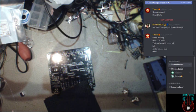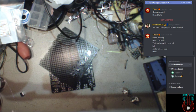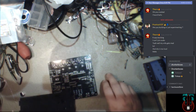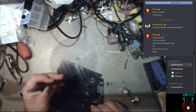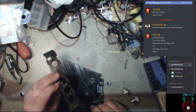So I just designed and 3D printed this to build this box, and I did it in multiple parts to make it easier to add components later, because this board has optional components to it. And knife safety, children. I want to be able to add them later. And if you solder the coax to the board and then run it through the holes, not gonna work. How's the YouTube audio sound?